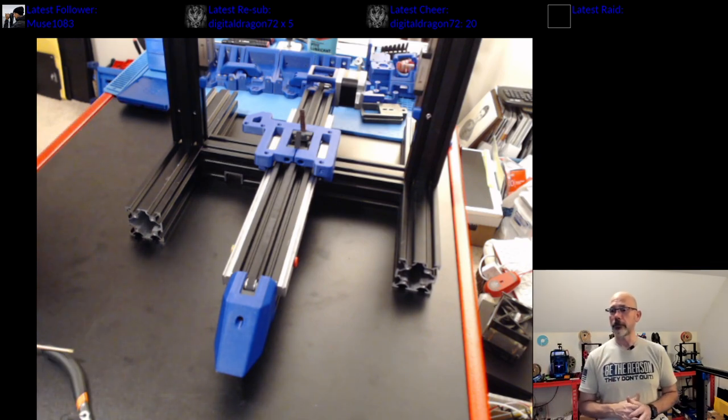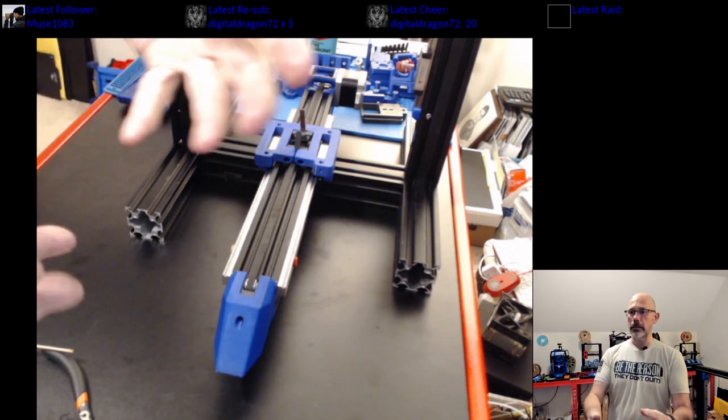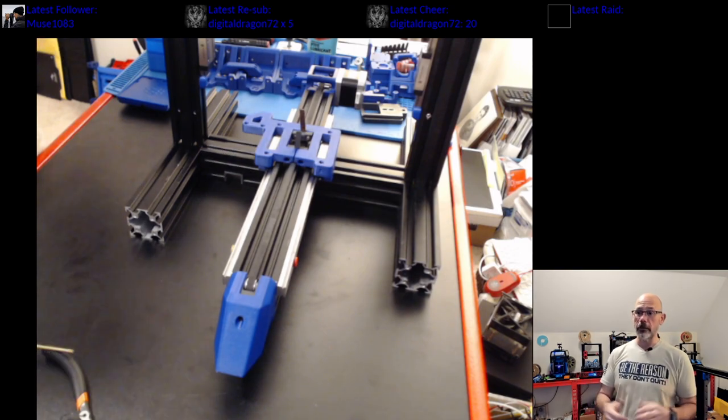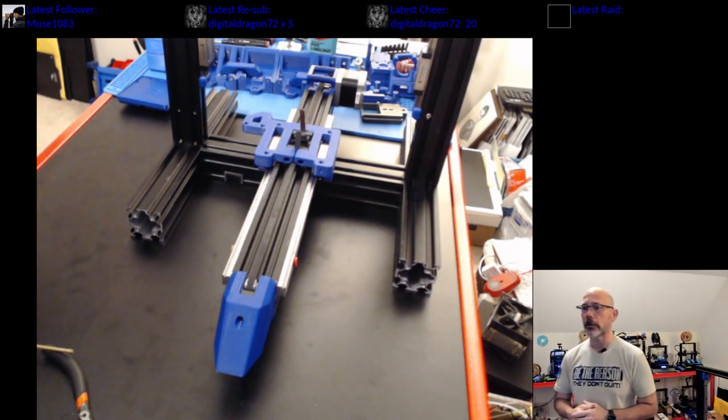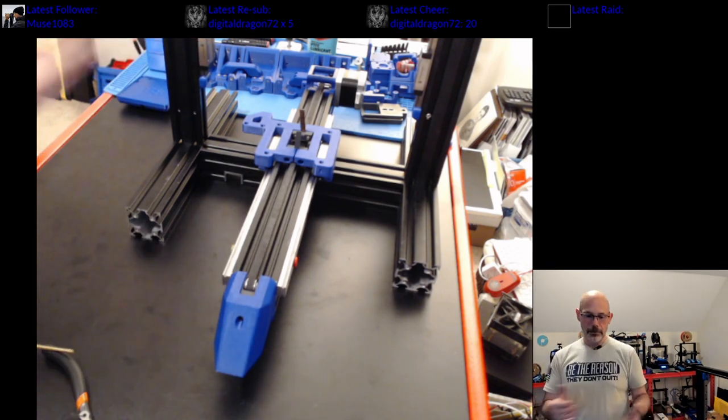Oh, I've got a Marlin build for the Tarantula, and when it does get rebuilt. So the original Tarantula board, I, of course, melted the bed connector on the controller board, like just about everybody does. So it was soldered directly to, and then I ran that into a MOSFET from then on out to offload it off the board. Exactly. You use what you have or you make it.